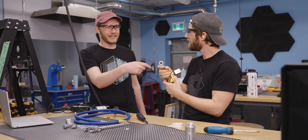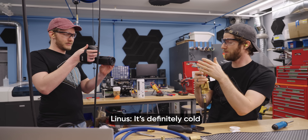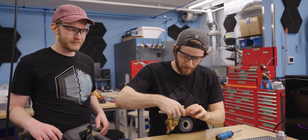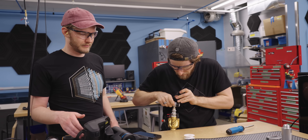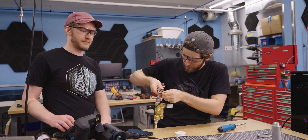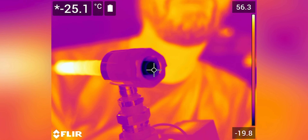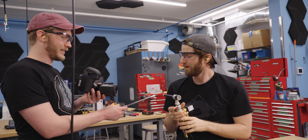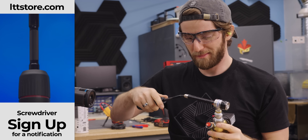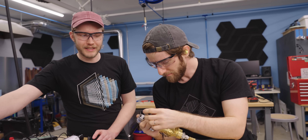Initial test: it's definitely cold on one end and definitely warm on the other. The plastic nozzle is reading about minus 30 to minus 40 degrees on the FLIR. There's a lot of moisture — our hands are getting wet from the condensation. The 15 CFM nozzle should give about 300 watts of cooling theoretically, which is getting dangerously close to what's needed for CPU cooling capacity.